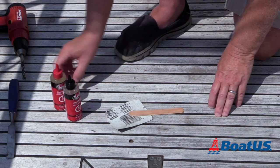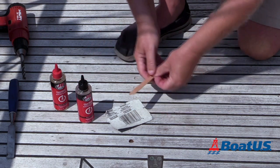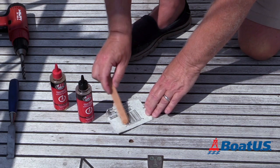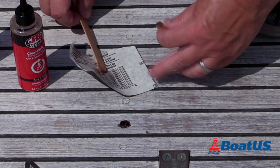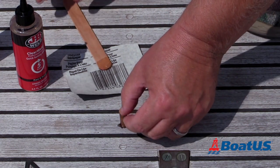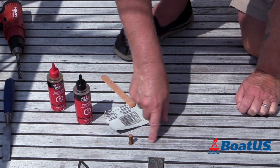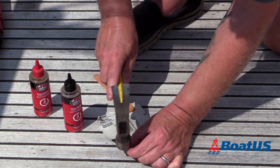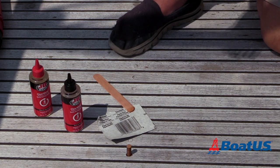I'm using a little quick-set epoxy — it doesn't matter what brand you use. We just mix it according to the directions; this is just a one-to-one mix. I'm doing it on a bit of old sandpaper, but a bit of board or anything will do. Now that we've got the epoxy mixed, I just coat the end of the bung and then put it into the hole. We want to make sure that the grain in the bung is in line with the grain on the deck, because if it's not it will show up once we've cleaned it down. I'm just going to tap that in, and now I'm going to leave that for the epoxy to set up, and once that's dry we can come back and clean it up.